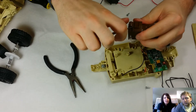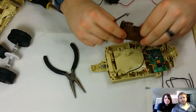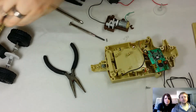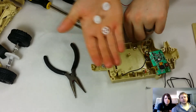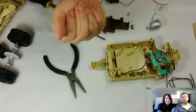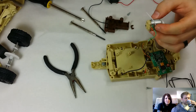Here he's just pulling the gearbox open. There's going to be another motor and some gears in there. If you get a gearbox, the gears basically increase the torque of the engine. In this particular case, the gearbox just goes left and right to steer the wheels, so I don't need that. I took all the gears out — I'm going to give them to her to paint into cool steampunk gears. And I just want this motor right here, which I'm stripping with a 22-gauge wire stripper.